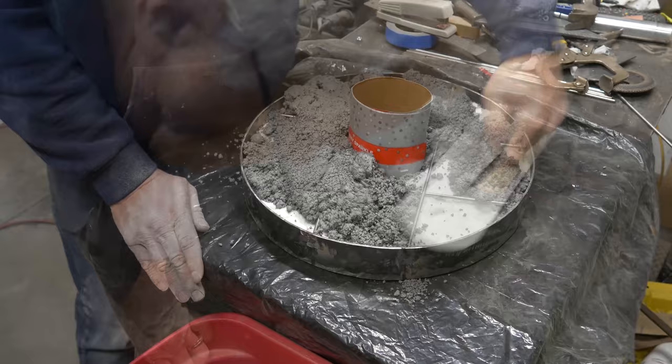That's without forced air — if I turn on the air, there you go. This is my number four crucible. You can see how much room I have — tons of room. I can melt that thing full of aluminum in fifteen minutes from the time I turn the furnace on to the time I pour. Fifteen minutes. Here's a number eight crucible — much larger in size — and there's still plenty of room in there for the larger crucible.